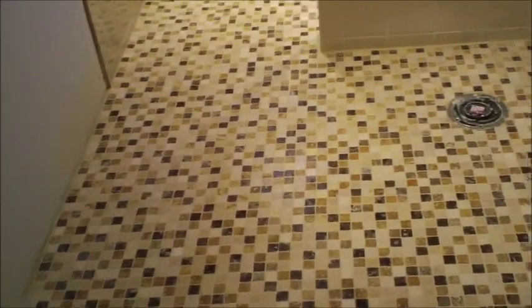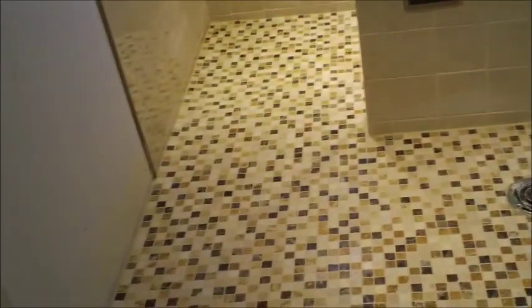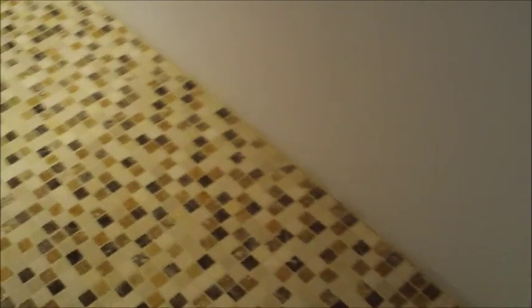It's kind of warm all of a sudden here this afternoon. But the grouting is done — she's all mopped down. I'm going to wait about 15 minutes and give it one final wipe down with the mop. I'm pleased; didn't get a lot of schmutz on the wall. One of the reasons I didn't want my buddy Vince doing the grouting was because he put so much black grout up on the sides of the wall and I had a hell of a time getting that off. You can see you don't always have to slop all that stuff around to do a good job.